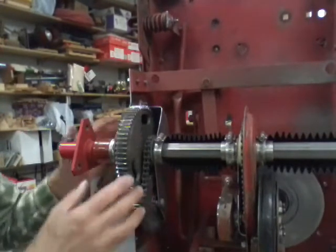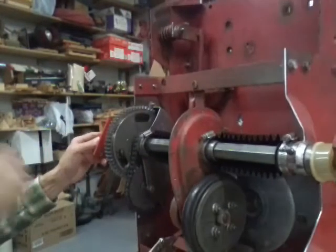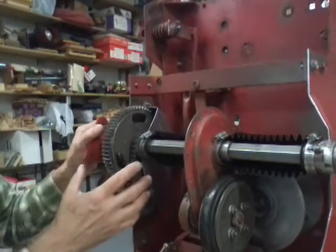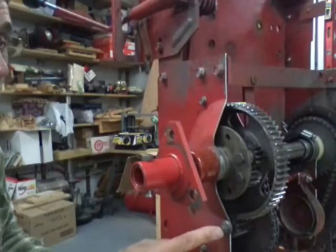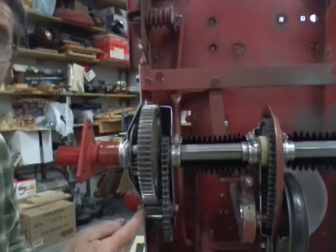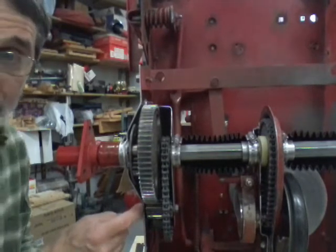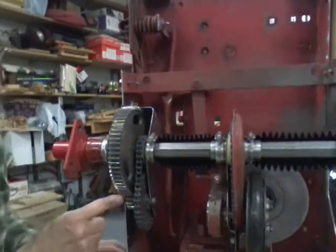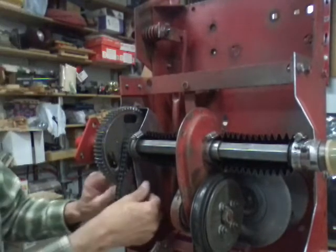Once you get this out on the bench, take all the screws out — probably about eight of them — holding this cover on. Take the cover off and you'll find a mess in there to clean out. On the outside, there's also a 5/16 bolt with a cone-shaped cupped washer. Underneath that washer between the frame and the washer is an O-ring — that's what keeps oil from leaking out. There's the same on the other side with a cupped washer and another O-ring.